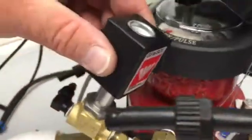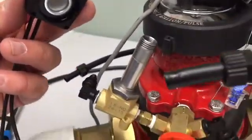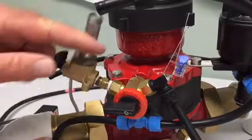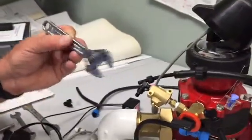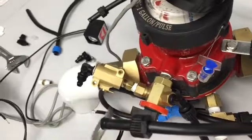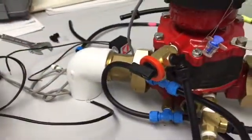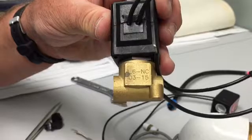Take the nut off the top of the solenoid. As you lift the solenoid off, it's important to remember to never take the solenoid off the post while there's power to the solenoid — that will damage and destroy the solenoid coil. Once you get this off, you can now twist the base off. I would normally use an adjustable wrench or an open-end wrench — either 9/16ths for this nut or 7/16ths for this nut — but one adjustable wrench will do both, so that's my preferred tool.